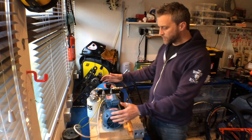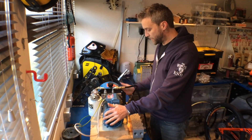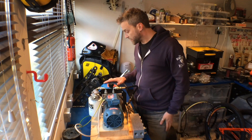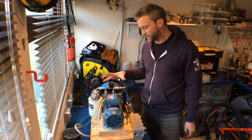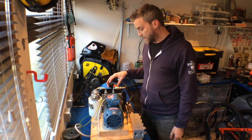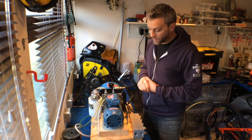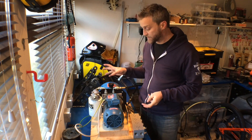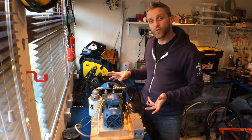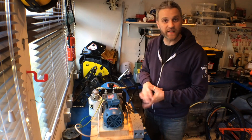I picked up this little single phase power pack unit on eBay - it's a bit of a bargain. It's an old Smiths Industries hydraulic unit used for scissor lifts in garages. It's got a half kilowatt motor as currently configured. It can deliver 70 bar pressure at about 4 litres a minute, which is fine for just testing on the bench.